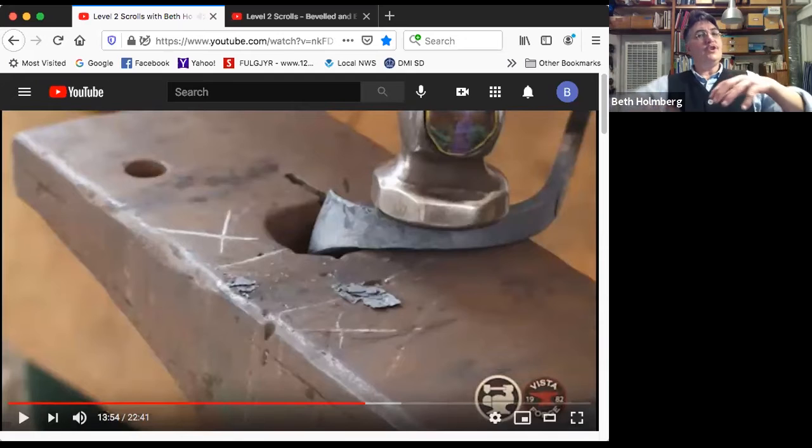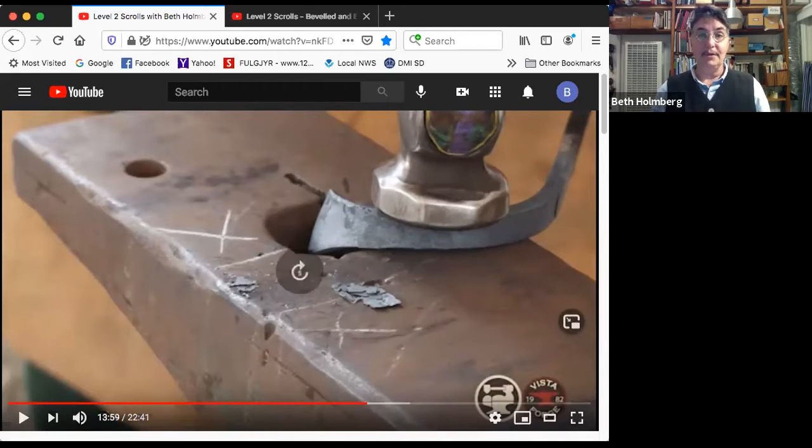All right, if it doesn't stay centered and you've got to get it back into one plane, protect the points. I've got this on the anvil here where it's touching there and touching there, and there's a little air underneath it here. This is the section that'll flatten out. Because I've stuck my finial into my hardy hole, that nice swoop and the points in the end are protected. Nothing bad can happen to them.